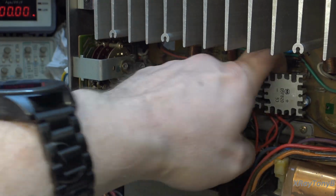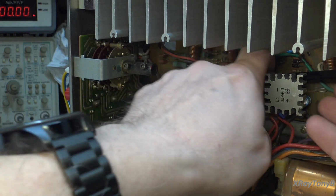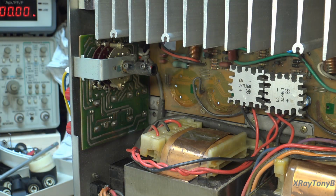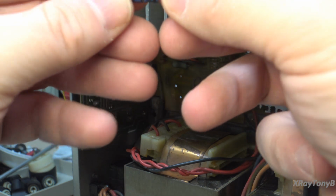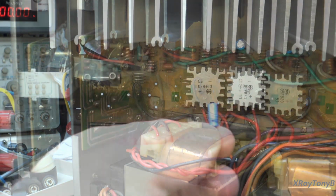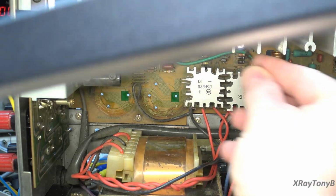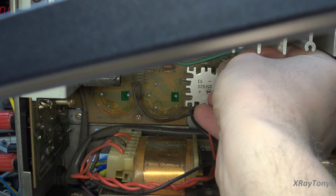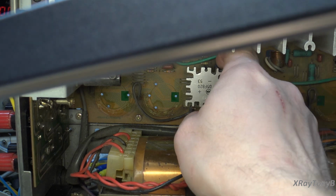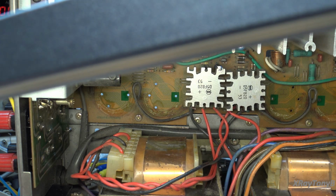Oh, look at that. Now it fell underneath. Ah, lost it. Ah, pachinko. Alright. 33 at 10 volts. Nice. Okay, I don't have one of those fancy ones in 33 microfarad, but I do have a KT series, which is a 105 cap, and it's in a really nice small case. So it should be tucked up under there out of the way. Heat rises, so I think we'll be all right.